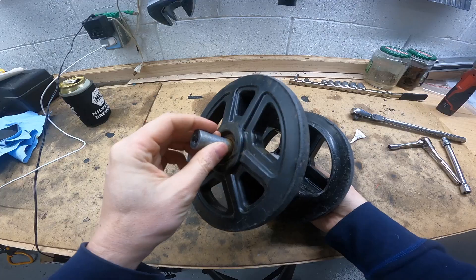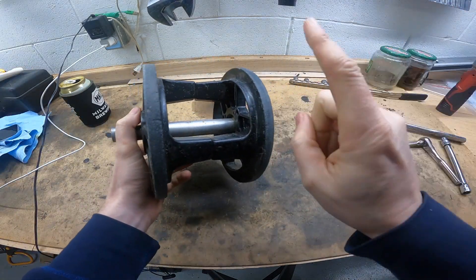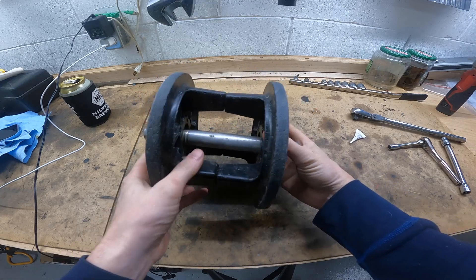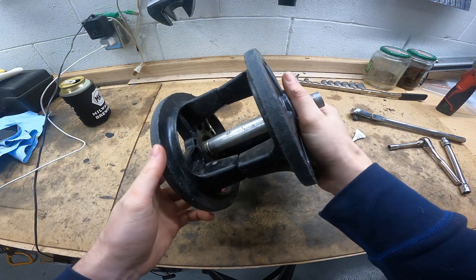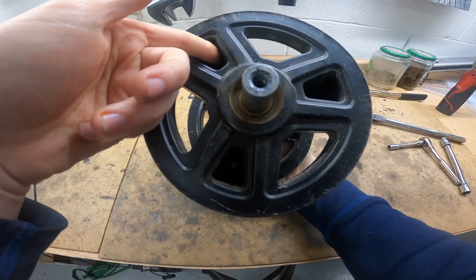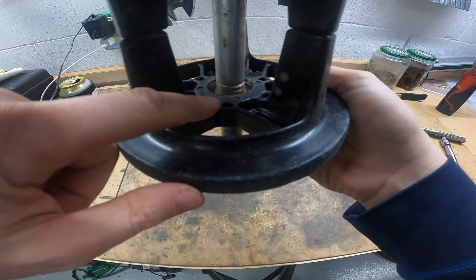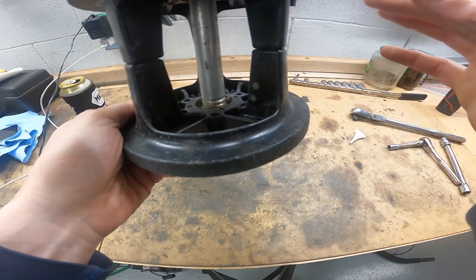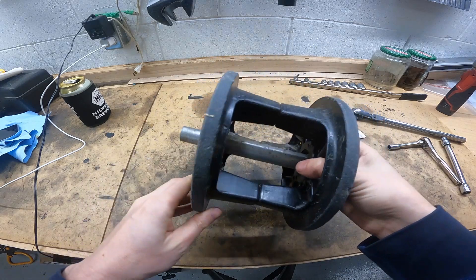Here's the tri hub and here's the axle — as you can see it's really hard to turn. No big deal, just replace the bearings, right? Well, that's where you'd be wrong, because some idiot at Arctic Cat decided they would put the bearing in a tool and then mold the plastic around the bearing. They did update this on later models — I think 2015 started coming with replaceable bearing versions — but on this one there's no clip on either side of the bearing. You have to separate it, pull the axle out, then use a hole saw to cut perfectly centered and remove plastic until you get to a metal washer. It sounds like a lot of messing around and I'm not sure it's gonna work that well.